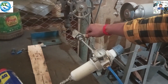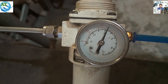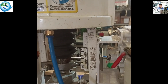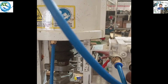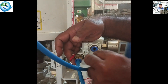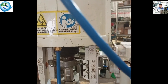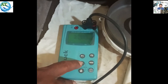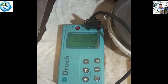We open the air supply — it is 4 kg per centimeter square. The supply has to be 4 kg per centimeter square. Now it is at the zero position. In order to open the valve, if we supply the air line, this valve will not open — it must be in the closed position. When we give the signal from the generator or the DCS, then the valve will open. I have opened the air line and with only power supply, the valve is fully open, which is not desired.